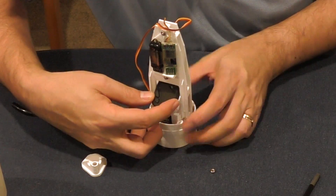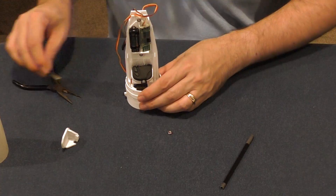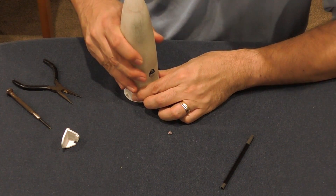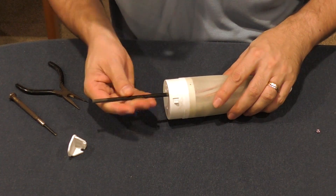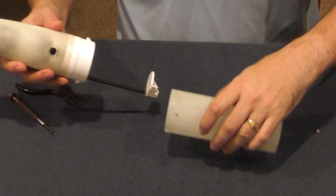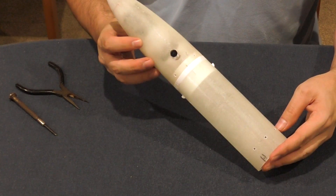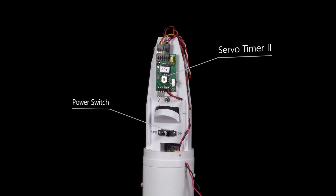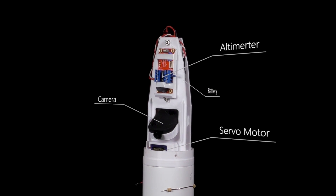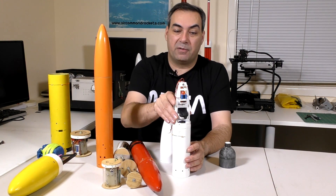The camera comes next — it snugly fits into the bracket and gets locked into place with a piece of foam, making it easier to remove when we want to download the video. Then the nose cone goes over the top. We insert the post into the bottom of the cup and attach the ejection plate at the bottom — these will be epoxied in place. Here it is all fitted together and wired up. In this configuration the Stratologger altimeter is set up to detect apogee and signals the servo timer to activate the servo.